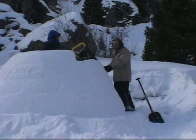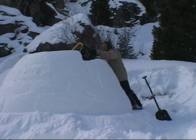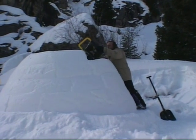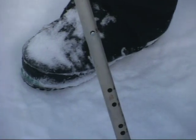So we're going to change the pole length now, so I'll lean right on the wall and grab the form, and the guy reaches down inside and changes the pole. So the bottom down there, we moved it from 4 to 5. That's a big change. So up on the top up here, we shortened the pole up by just 1 hole, cheated a little bit basically. Now we're all the way up on the 5th course. He's going to change it back to the first hole again.